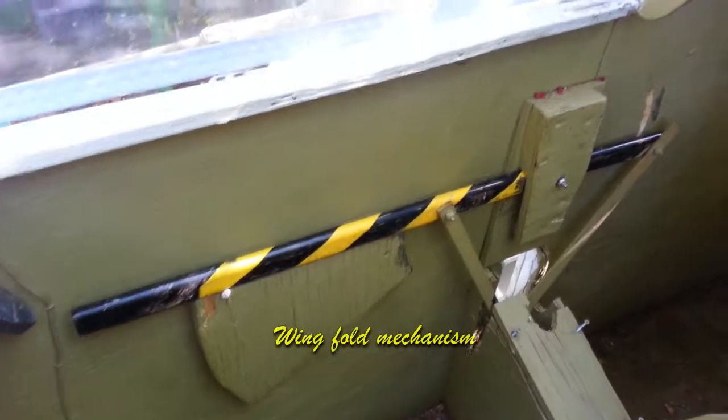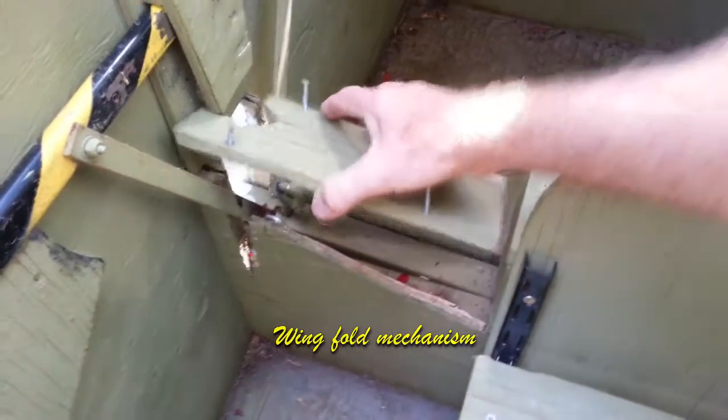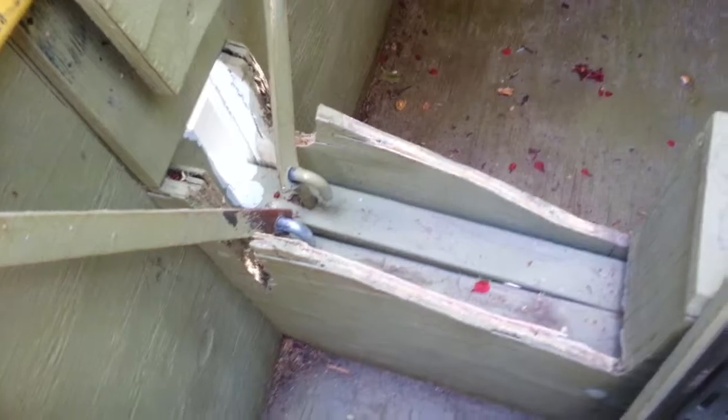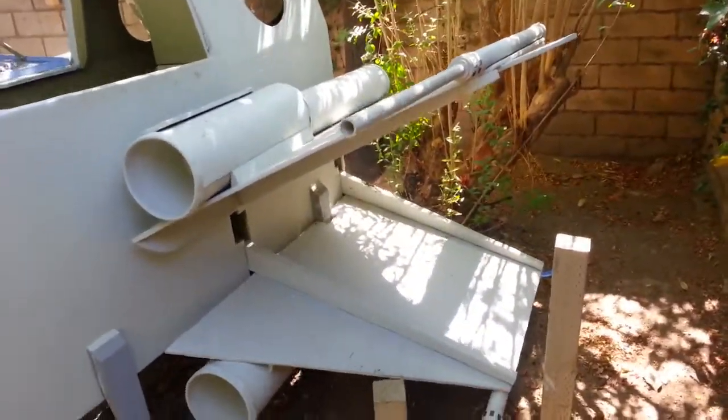Here are details on the wing fold lever shown in the closed position. With the screws removed, you can see the wing spars with 5/16th hook bolts going through each spar. As the wing fold lever is pulled out of the detent and pushed down to the bottom detent, it can lock in the wings-out position. Pulling back, we can see we are in the flight position on the wings.